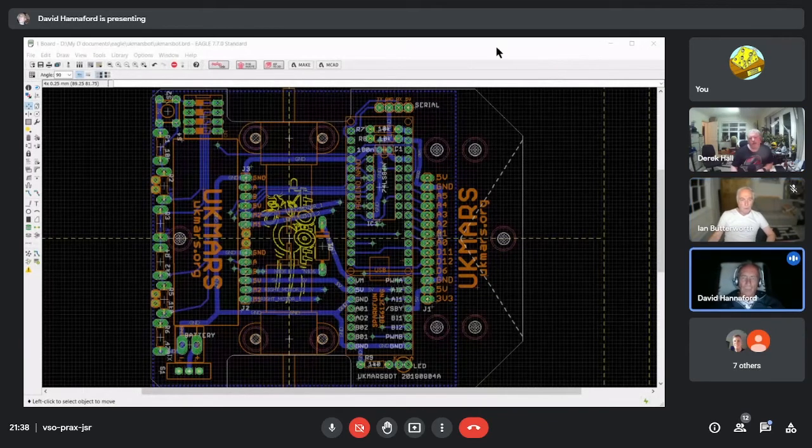Okay. So what I've done is I've increased the width and the hole size on all these resistors down here, and moved them so that they offset slightly, which means you've got less chance of soldering into the wrong hole and bunging up the wrong hole. I've also increased the pad sizes down here so that it's easier to solder the wires that go on to the sensor board.